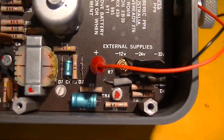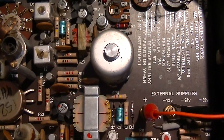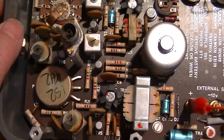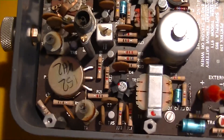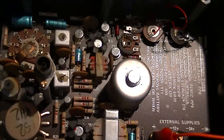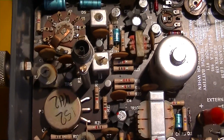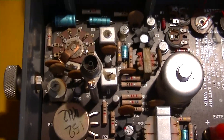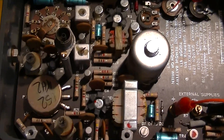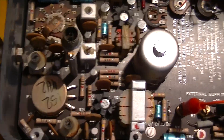I'm going to have to go over the schematic and understand how this thing works. What I'd like to do today is fire it up and see if the flasher flashes, and maybe try to get a frequency counter on it to see what it's really doing. I don't know what happens if you run this thing without a load on the transducer port, but probably nothing really bad — I might put a dummy resistor across there just to give it a load.